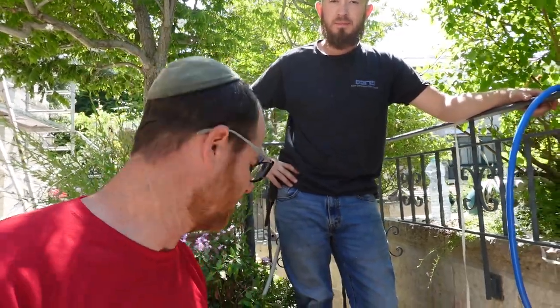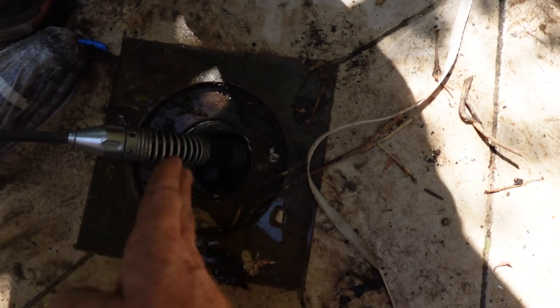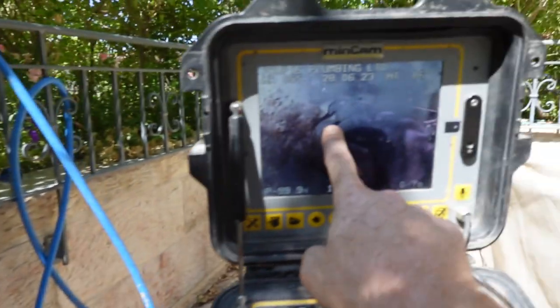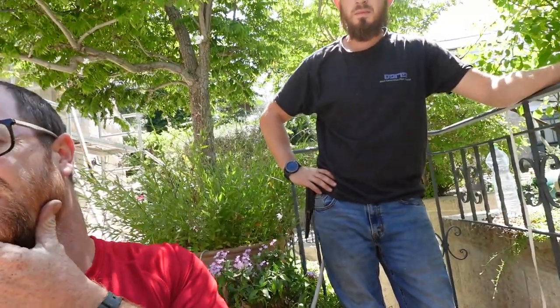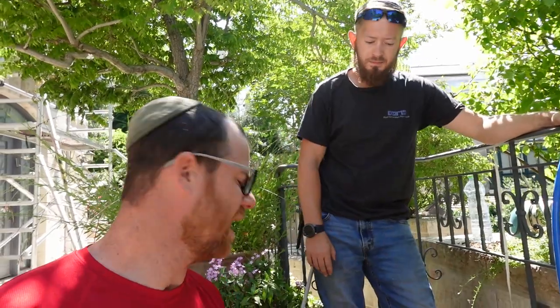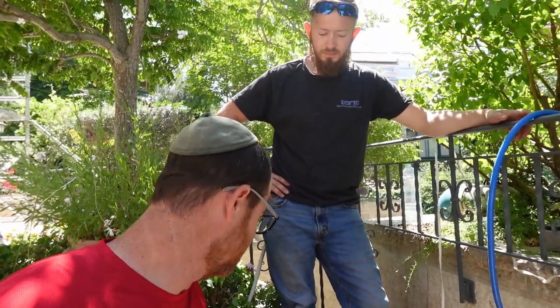After a whole series of testing to confirm the location, we found that this drain goes down with a 90-degree bend and right there there's a hole in the top of that pipe - you can see it right there. That's what's been dripping. Also it's a 3-inch pipe going into a 4-inch. We're going to see if we can get authorization to do a patch near the 90 - it's gonna be complicated to put the packer in that close. We tested from the T all the way here and no water drop and no leaking anywhere else, so hopefully that's all there is - though you fix one issue and sometimes find a secondary issue.